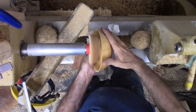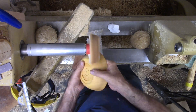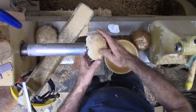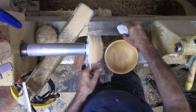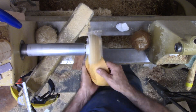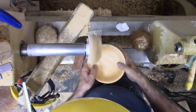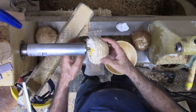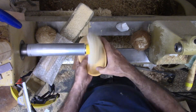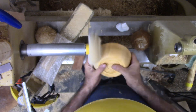I feel that this bowl needs a good buffing. I am using bowl buffs with Tripoli, white diamond, and carnauba wax. With the small diameter buffs, I turn up the lathe speed to compensate. The buffs are mounted to a spindle extender which gives me room to maneuver the bowl. I was not familiar with this wood — it was somewhat on the soft side but very consistent in density with no prominent grain differences. It has enough pretty grain to be attractive and has a great mellow color.